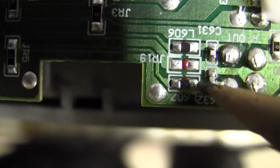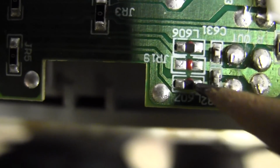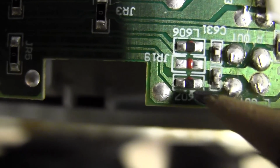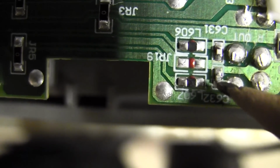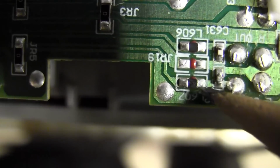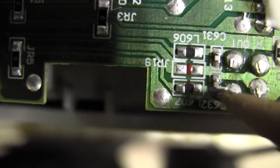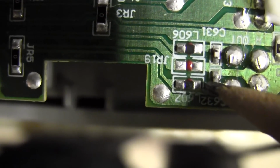Both of those procedures can hamper or decrease the high frequencies. Why did they put these in there? Probably to filter out noise coming from either the motor or the circuitry that converts it to digital for USB. There probably was some digital noise, and they had to filter it through these. So the trade-off is you don't get the noise, but you also lose a tiny bit of high end. We think. We don't know yet. We haven't done the comparison.